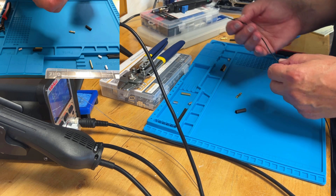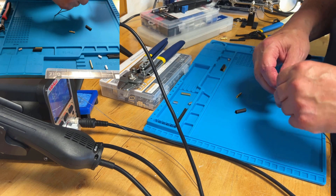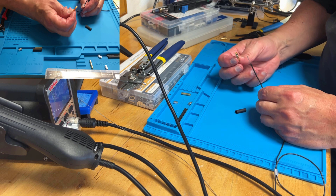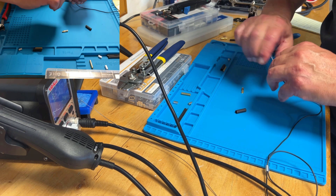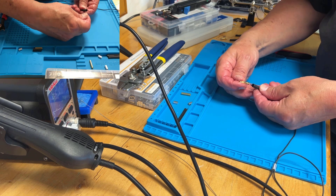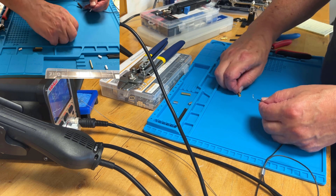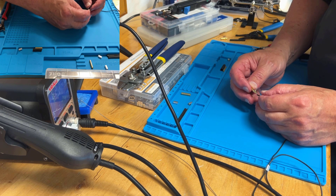Be careful not to fray the wire because it's not pre-tinned anymore. We're going to take that sleeve and get it really far out of the way because we're going to heat this up pretty good based on the mass of this banana plug — going to take a different solder tool to it and get it pretty hot. Next up will be our heat shrink that will encapsulate the end of our wire and our banana plug. Now let's see if we can weave this wire into that hole. Just going to put a little bend on it. You need miniature hands and I've got sausage fingers. Look at that — that worked. Fantastic.